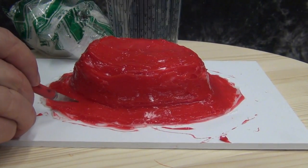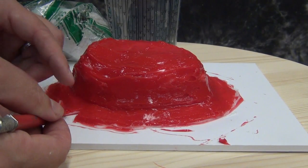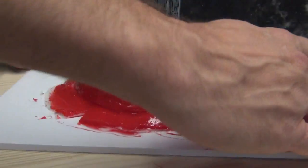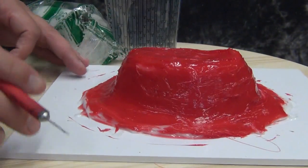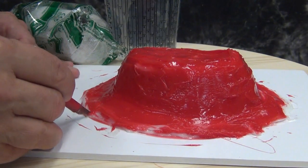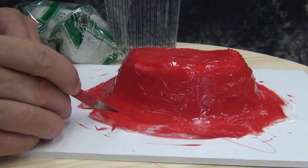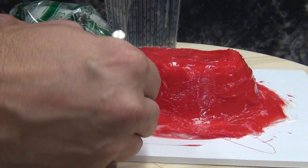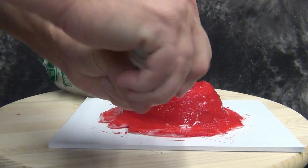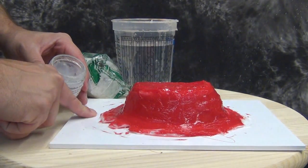Once that final layer has cured, we're just going to make some quick registration keys by cutting some notches in the rubber. You can do more elaborate keys as you might have seen in our other videos — the little pre-poured nibs stuck on the outside of the mold. But just for the sake of time, we're making little V-shaped notches to help us realign this in the mold. Since we've simplified that form, we want to make sure we know which way it goes later on. Now we're ready for our plaster bandage shell — we opted for this for the sake of speed, since you can make a really fast shell with plaster bandages and it holds up well for reasonable production use in a shop.